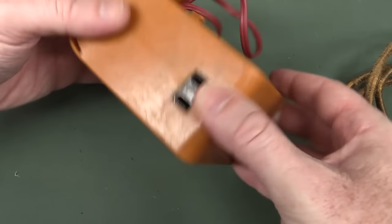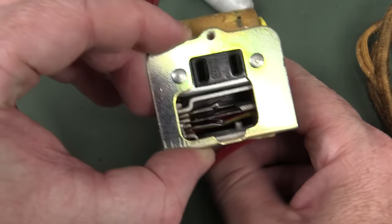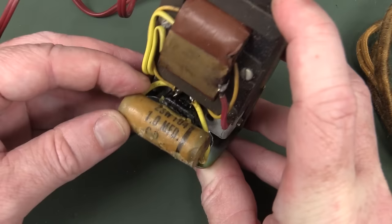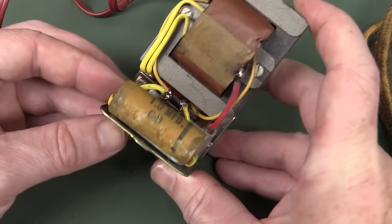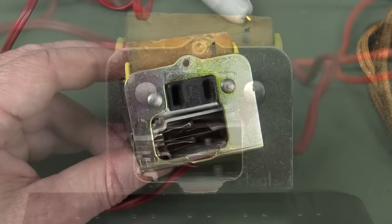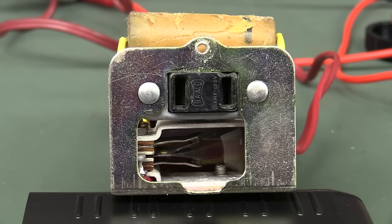Isn't that a funky case for it? Let's crack it open. It's a mechanical vibrator! Mechanical vibrator inverter! Designed to generate 120 volts - that American rubbish of course. There's a 1 MFD - none of this micro symbol rubbish, good old MFD. 1 MFD for all you non-old-school people is 1 microfarad - that's how they used to write microfarad back in the day. It's a mechanical vibrator that converts the 12 volts DC from the car battery into 120 volts AC. It's so loud! If you want to see this in 1,000 frames per second, click here and go over to my EEVblog2 channel.